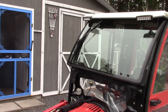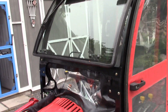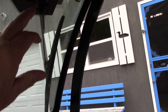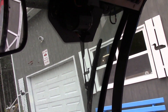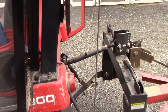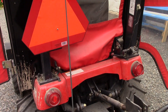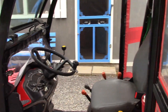The wiper clears good visibility on it. There's a wiper motor integrated into the windshield — you'll see that from this side. The wiper motor here has its own on-off switch. When I got this cab, that was the only electrical part to it. So I ended up wiring that into the auxiliary circuit that shows up under the back fender of the tractor — there's an auxiliary plug there, so it just tied into that. And in fact, I use that now for all the lighting on the tractor, for the work lights and everything.